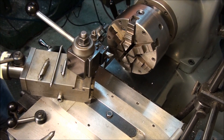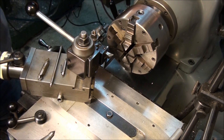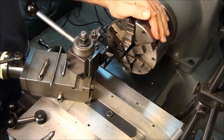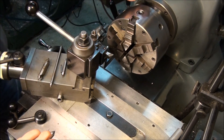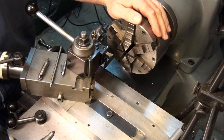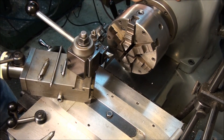Tonight I'd like to talk a little bit about center drills and center drilling. It's pretty simple, as long as you do it correctly. But like anything else, if you do it incorrectly — and there are a few ways to drill a center hole wrong — it can come back and bite you later and cause problems, because your part basically revolves around the center hole in the lathe. So if it's not put in right, it can transfer into problems later on.